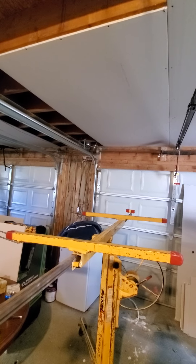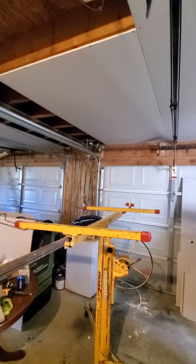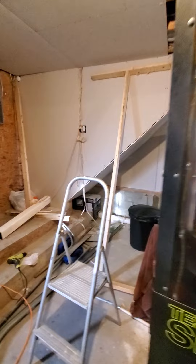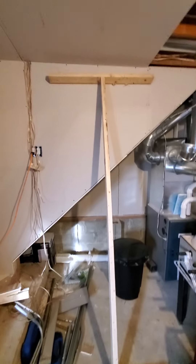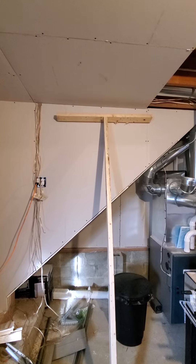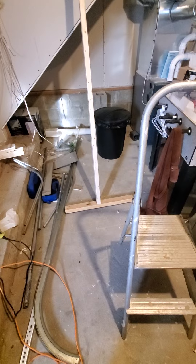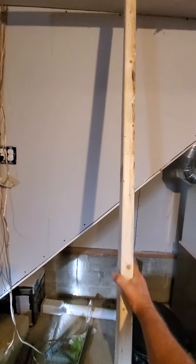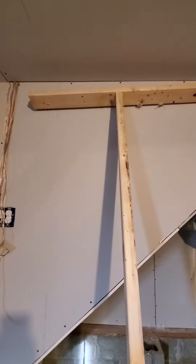It's not only a time saver, it really is a back saver — because we tried a couple of sheets climbing up ladders, holding it with your head. I also made a couple of T's. They started off as T's, they ended up being I's. I took an eight-foot two-by-four, not a stud, put a three-foot piece at the top and a two-foot piece at the bottom just because that's what we had for scrap. When we get the drywall up on the ladder, we can take these and pull them into position, and it braces the drywall up there so you don't have to keep holding it. Then you get it tight and put your screws in.